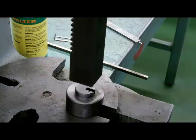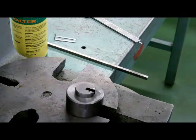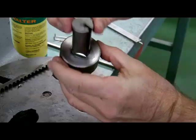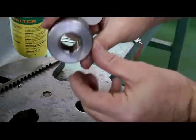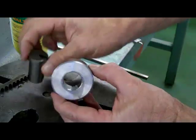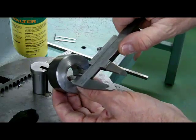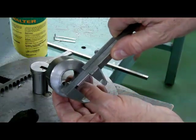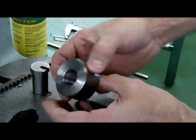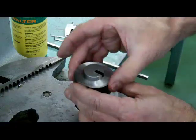What we've done is we've pushed the broach through this sleeve. If we pull out this plug here, you can actually see that groove that is in there now. Looking in the machinery handbook, we can find the dimension from the bottom of the bore to the groove. If we're not there yet, what I would suggest is flipping this over and coming in from the other side, in case that broach is starting to taper a little bit.